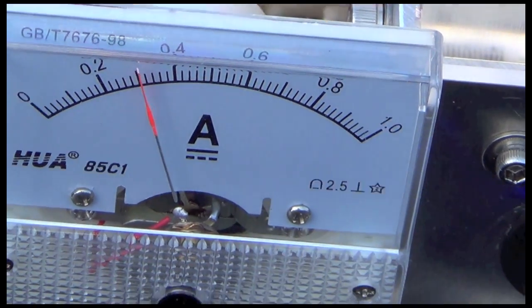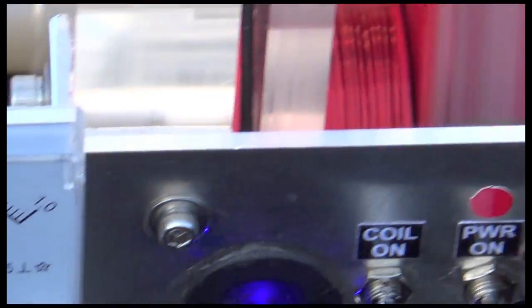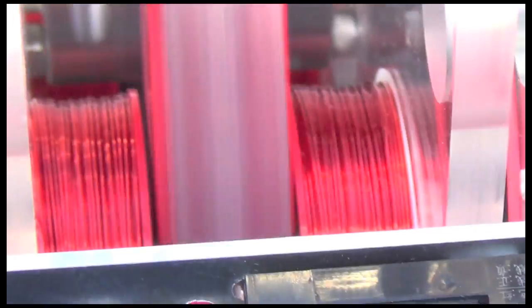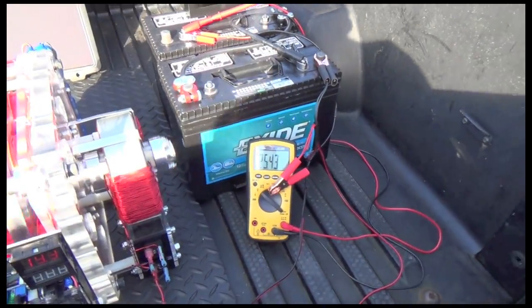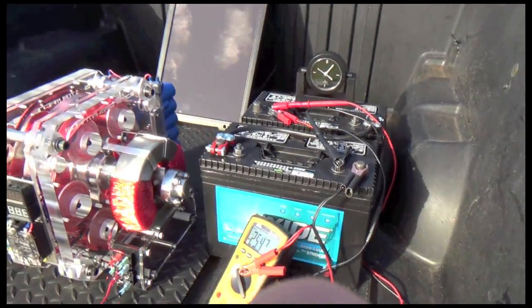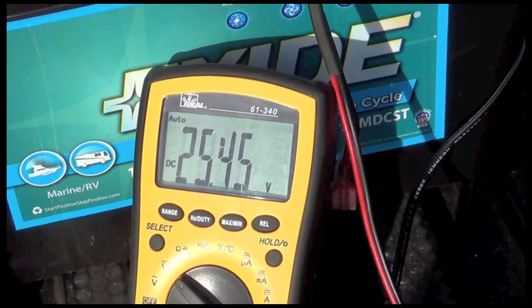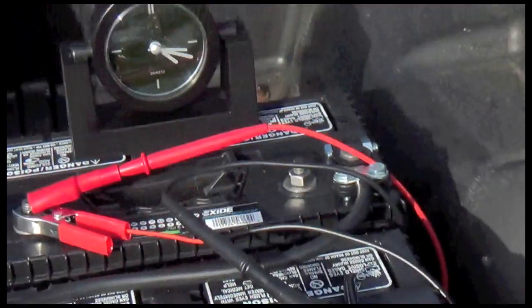We are drawing what looks like 300, maybe 320 milliamps or less — pretty close to 300 milliamps. So we're only pulling six watts or less, which is hardly any power. If this thing can do any kind of charging with that little bit of input, it will be what you might consider somewhat impressive. Let me just connect this other cable here.